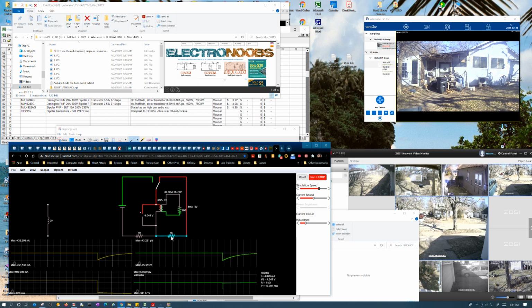This has got still a load connection, which in practice we wouldn't have, and we'd only have this. Okay, so if we only had this, this would actually get 100% of it. So that's what I'm saying. This is obfuscating, but it's still interesting to see what it's doing. I mean, it's interesting to see that it actually does still transiently have a very high voltage spike, and that it actually shares the current in a 1-to-10 ratio sort of way. It's actually kind of interesting. I wasn't even expecting to look into this, but I'm glad that I am.